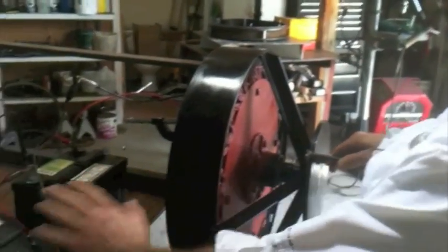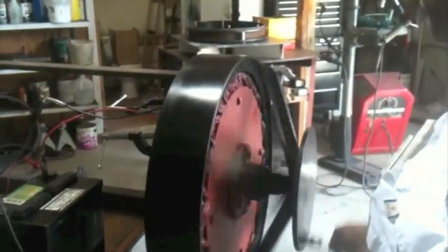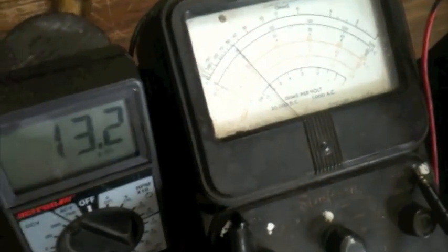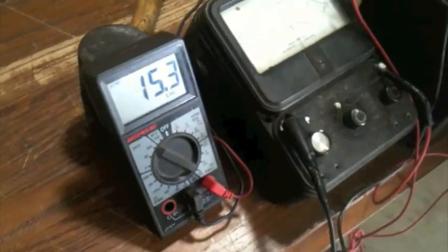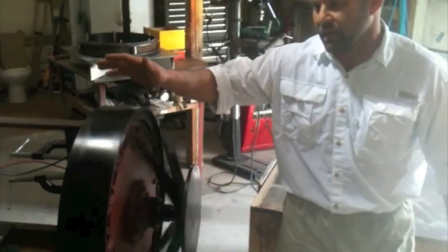We got it hooked to a battery, which is our load. You can see we're running a little over 12 volts and an ammeter. I'm going to start spinning it, and as soon as I get over 12 volts it starts charging. You can see I am at 2 amps and 13 volts. I'm going to put a little more power into this. Just a little bit of effort — I'm pushing 5 amps and 15 volts. You can see how slow it's going. At about 100 to 120 RPMs we were getting 100 watts, and at about 170 RPMs we were getting close to 200 watts.